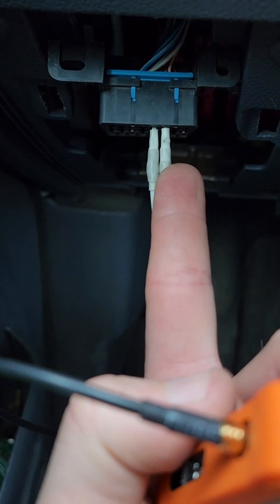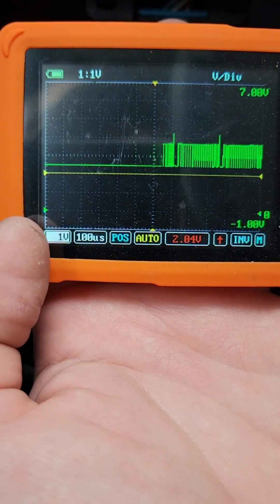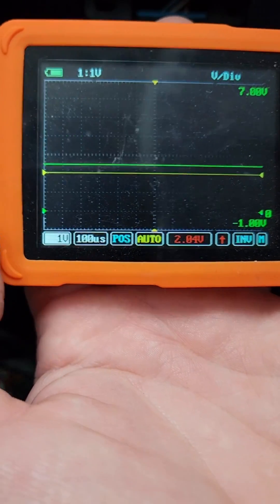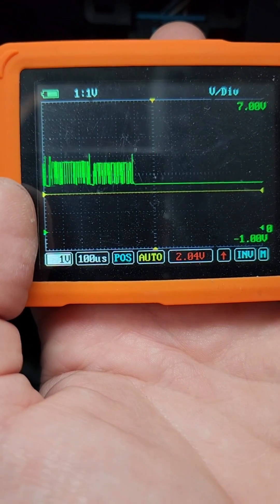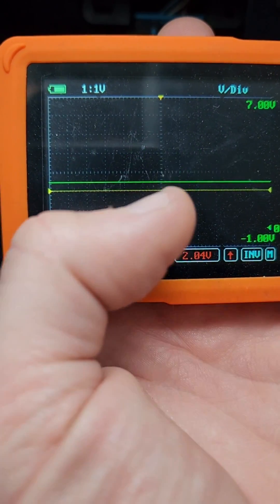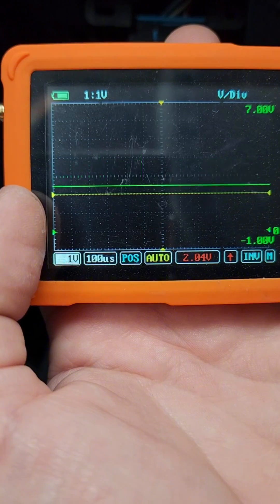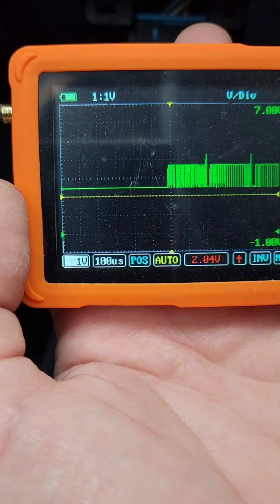If you're going to be going from ground to one of your signals, I have my voltage set to one volt. You can see the little green arrow here — that's going to be our zero-volt line. So one block would be one volt, then two volts, and you can see we're floating our bias line at about two and a half volts.